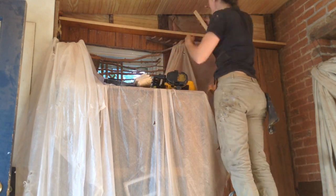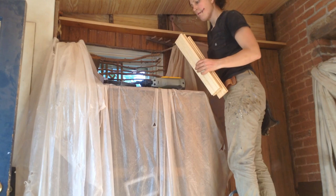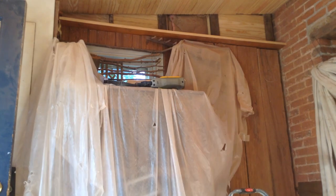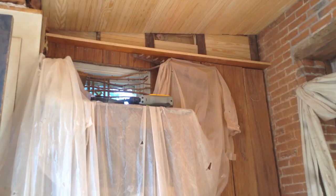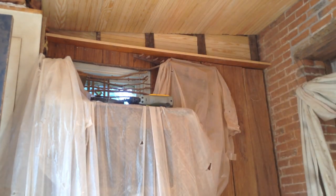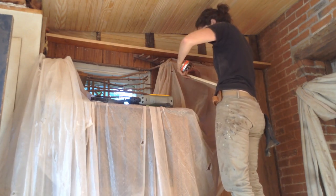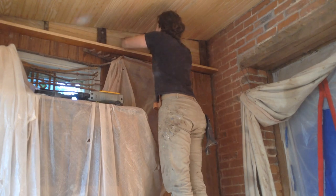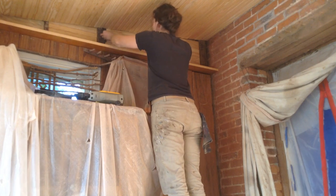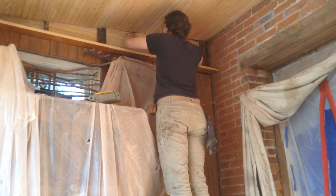I had a bunch of extra beadboard because the joists weren't 16 or 24 inches on center, leaving a lot of little chunks, so I decided to trim out the inside of those little cubbies. I put a shim in there to create a nailer and then cut the pieces and the triangles up top. This all still needs to be trimmed out. The finish on those is undecided — I don't think they'll be shellacked; they might be stained to match the wall a little better. So it's both decorative and added storage.